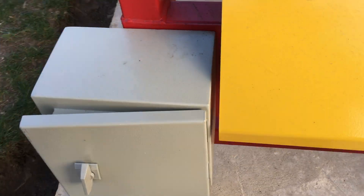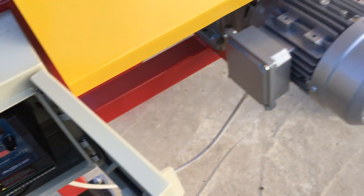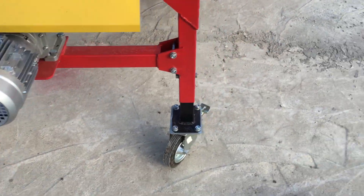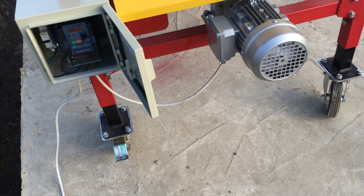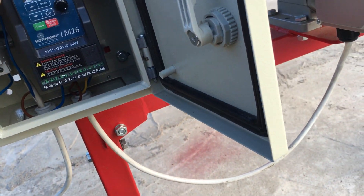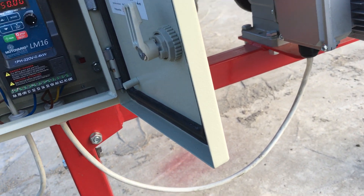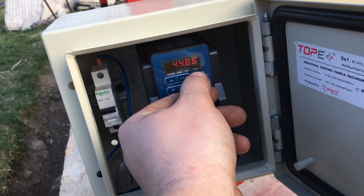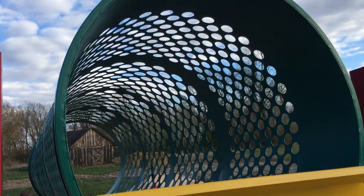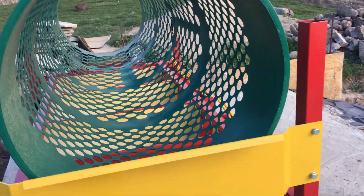Let's start this machine. I use a three-phase electric motor with a gearbox. It reduces spins. And I use an inverter to connect to single-phase electricity. That means you can change the frequency, and at the same time you can control the speed of the spinning drum.